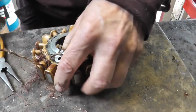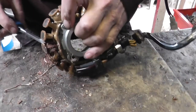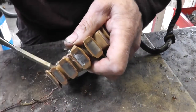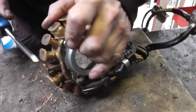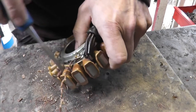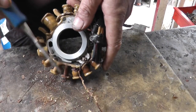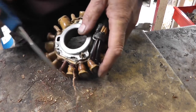You don't want to see me doing all this — I'll come back to it when I've almost done it. Right, so we've got the last bit of wire on there. That hasn't done too bad. Usually the old insulation all breaks off, but that's remained on there quite well actually. As long as you're careful with it, you can minimize as much as you can. But we will have to re-epoxy there because it's just showing bare metal laminated core. So we'll clean that up and re-epoxy that.